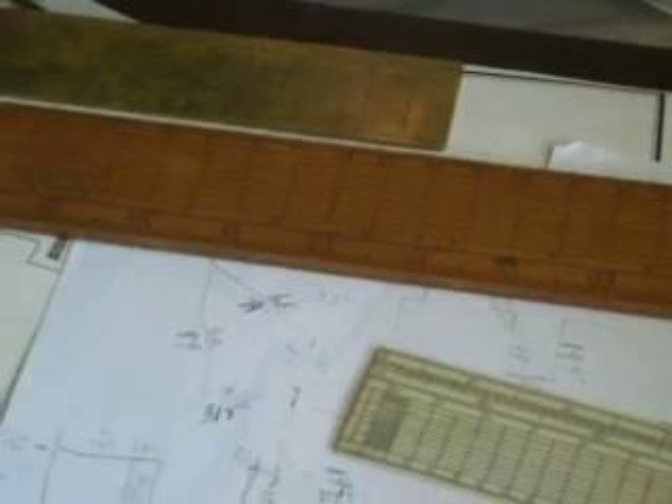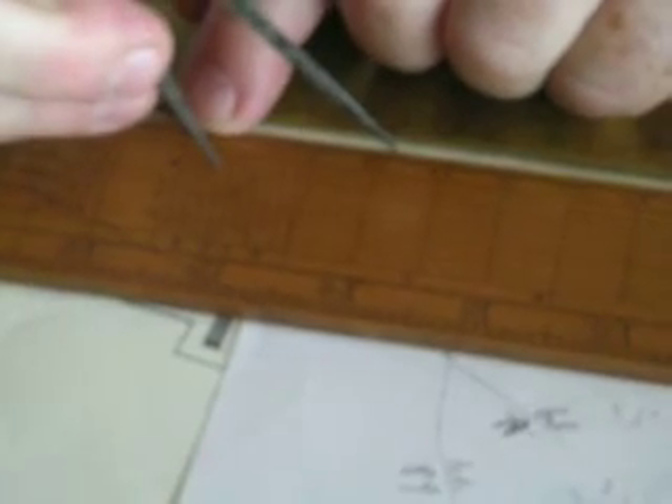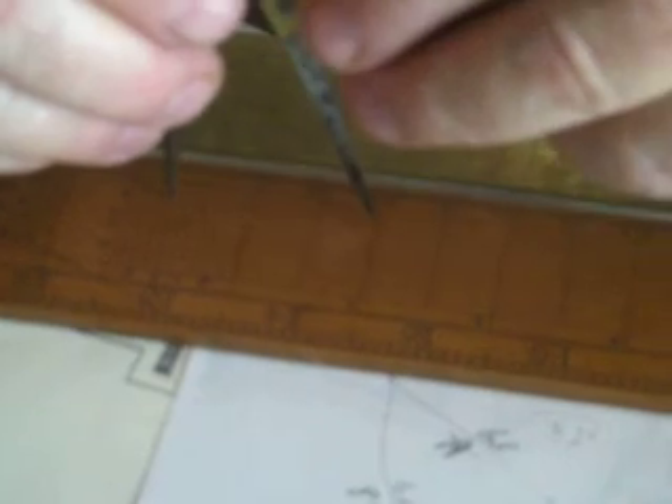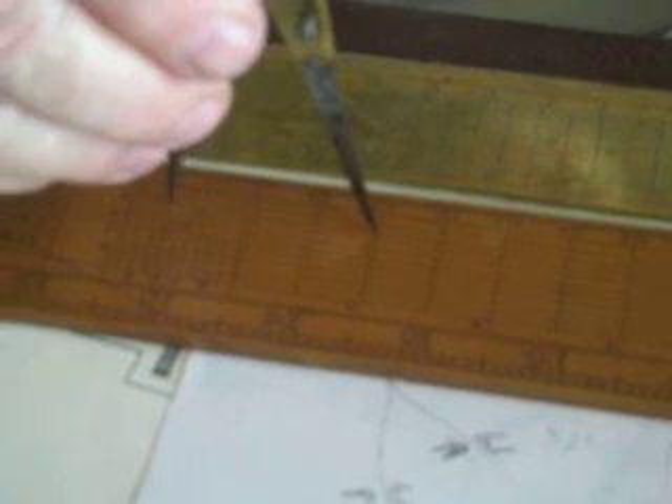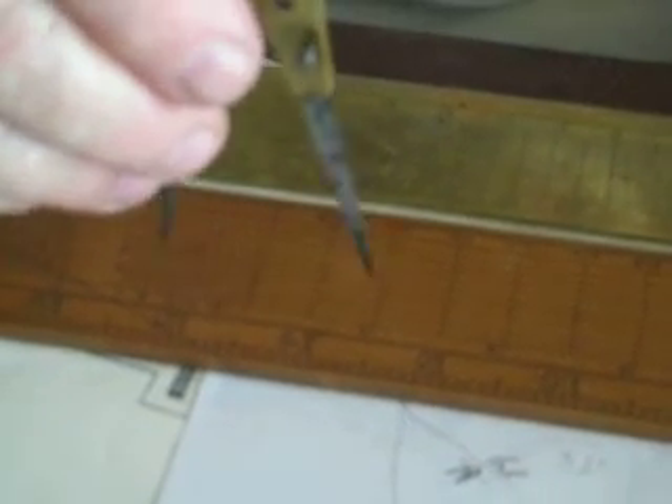So, we're going to use one chain, 68 links. All right. Here's one over here which we picked up. Now, to get 68, this is the line for 60, okay? But we've got to go all the way up here to eight. We're counting down that diagonal to eight. And so, we start at that point there — 68 — back to the one-inch back here along that line, the one that's parallel with it. Yeah, not the one at the top. That's why you've got these lines.